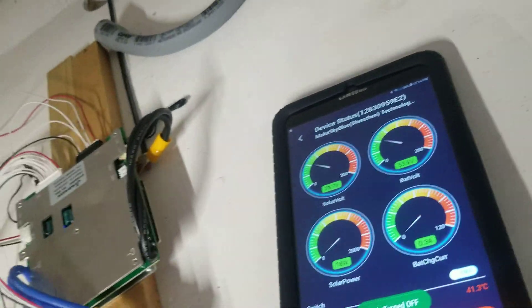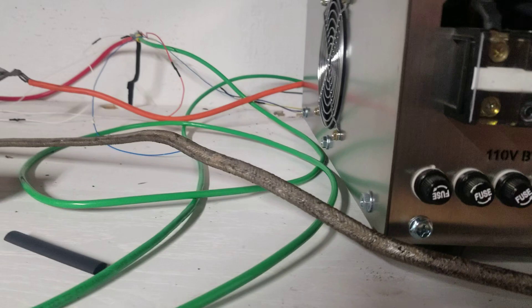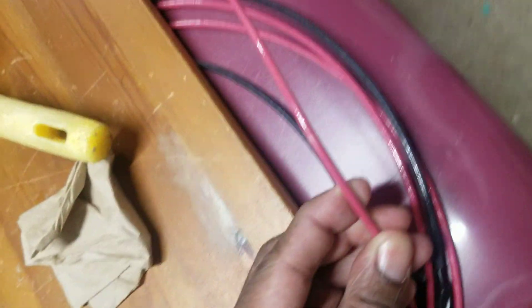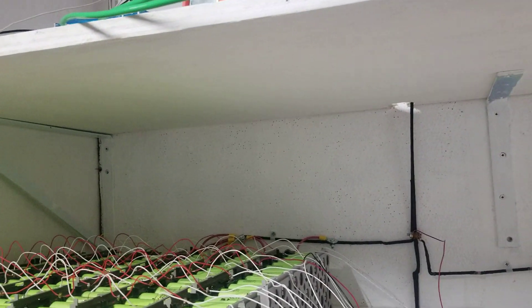Let me shut this thing before I forget. It's always good when you can do that with software — always have breakers if you're working on a pack. So I'm shutting this thing off. This video is about MakeSkyBlue and the connections and how I set it up — it's an upgrade. All the battery packs total about 10 kilowatts, and I'm going to have four more kilowatts coming in. I'll probably change the wires to 10 gauge, which can handle 40 amps.